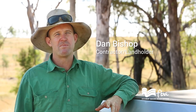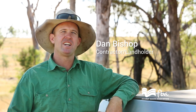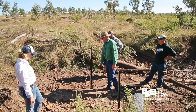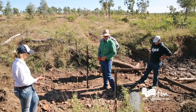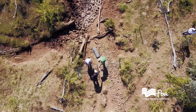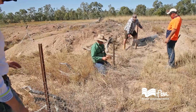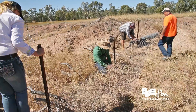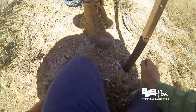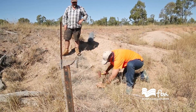The two types we have been building are a mesh steel post wedge-shaped design in the gully, where you put steel posts across the gully and then a plain wire across that about 400mm off the lowest point of the gully, then put wire mesh — chicken mesh, about 50mm diameter — 900mm long. The top end of the mesh is up off the ground 400mm, and the toe end on the upstream side is pegged into ground level nice and tight so no sediment, debris, or water can escape underneath. All the water is forced to go through the mesh and catch the debris on there.